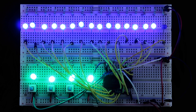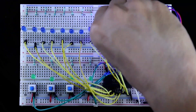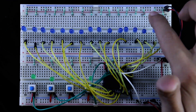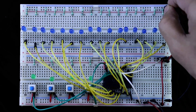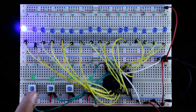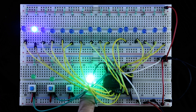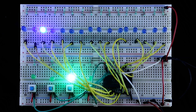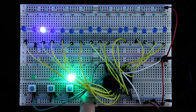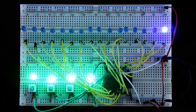To see it better, we have to connect the LEDs in the opposite direction. I will change the polarity of the LED and connect the positive supply to the resistor. Now with input 0, 0, 0, 0, the first LED is glowing — that is Q0. And you can see Q1, Q2, Q3, Q4 and Q15 demonstrated in sequence.